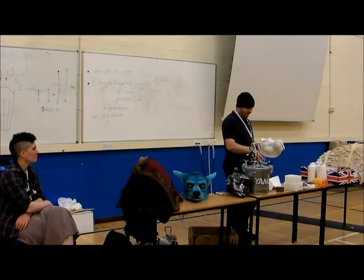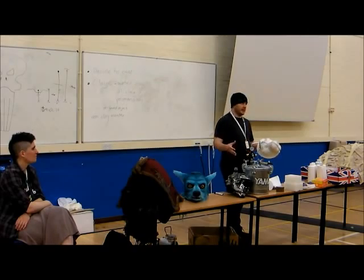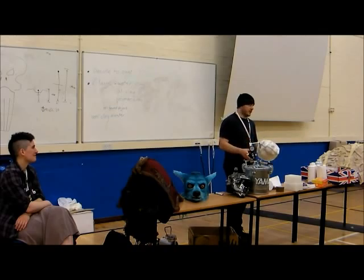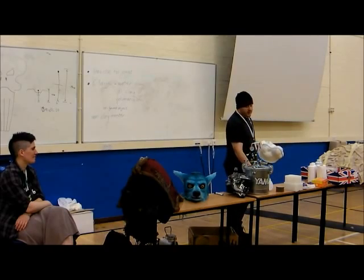And the big thing with plaster is that certain things will stick to themselves very, very efficiently. Plaster loves sticking to itself. So if you went ahead and just did that, you would find it's now just a one part mould.